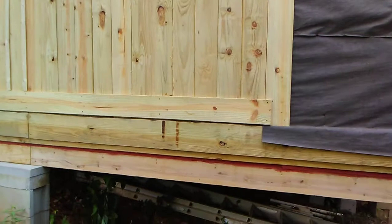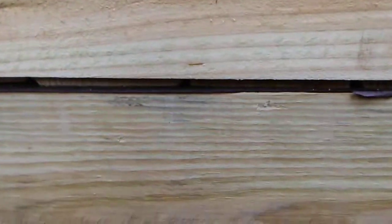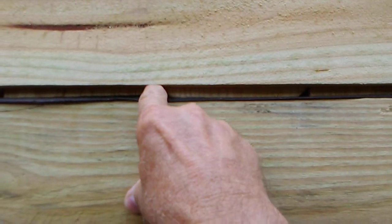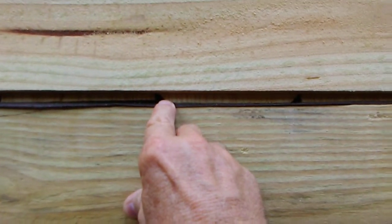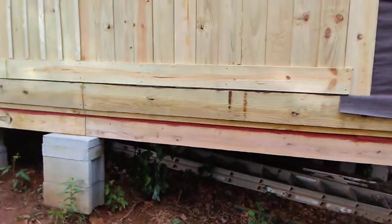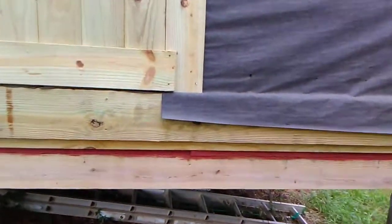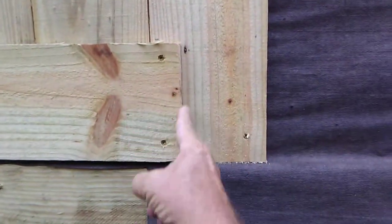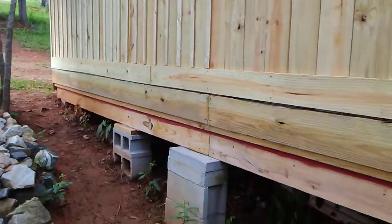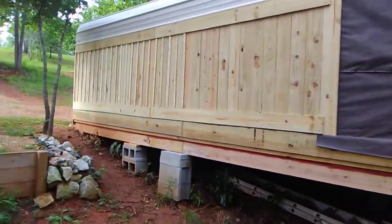I use one top and bottom so I don't have to even square off the dog ear. There's a little gap I left here for moisture drainage. You can see the dog ear on one end of the board — I didn't worry about trimming it off because the trim piece I put on there covers it and squares it up. The only thing I had to do was trim off the dog ear end so I could butt each piece up against each other, and it makes a really nice board and batten siding.